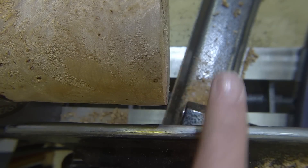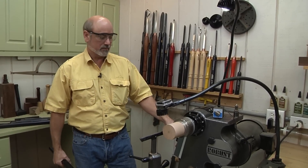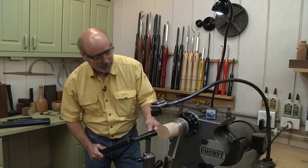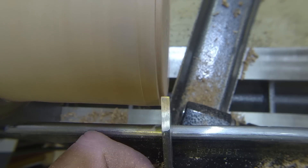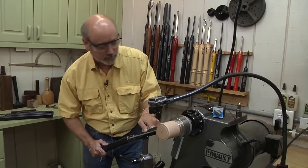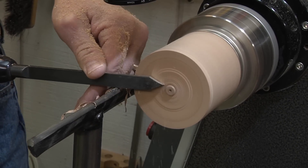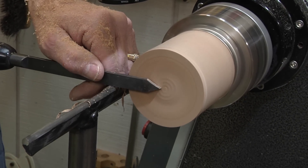All I'm going to do is trim up this bottom first and smooth this side out. I'll bring the parting tool in low, make contact, and I'm going to ride the bevel — you can see how it's riding right on the edge as I push it in. See how the tool rides and pushes down? That's how you do a parting cut or a cleaning cut. You don't push it straight in — you ride it on the wood as it goes down. There's a good bottom on that.